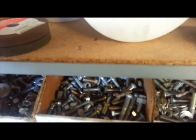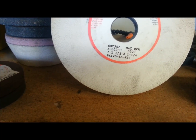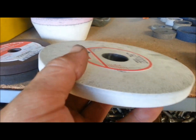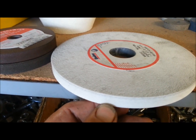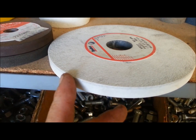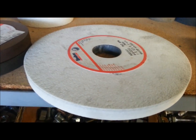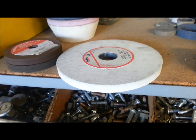I'm going to switch out to a butter wheel — a 120 grit. It's a very soft wheel that degrades and loads quickly, but the surface finish is nice and you can skim off a tenth with it. It's not coarse at all — no stray piece of abrasive coming down and plowing material. It runs very cool, a lot cooler than the ruby wheel. So I'm going to switch out the wheels, get them dressed up, and see if I can improve on my table a little bit. Let me get grinding and we're going to measure it one last time.